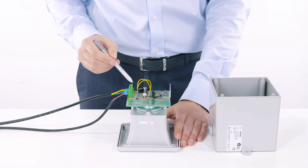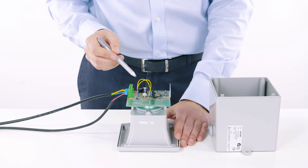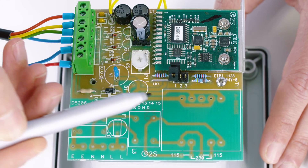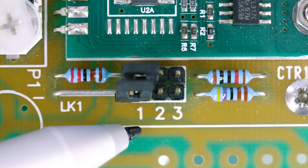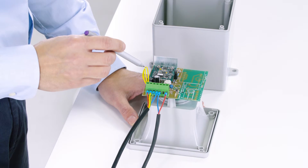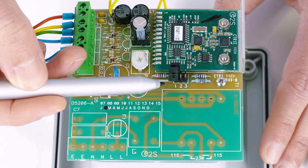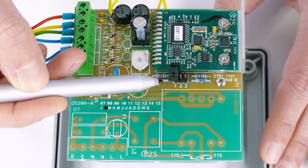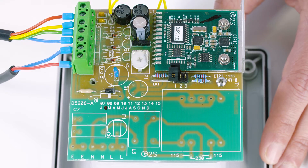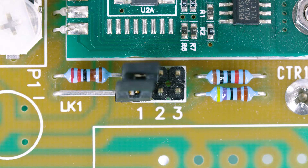Each of these sounds has two additional remotely selectable alarm stages. The first stage tone is selected by positioning the supplied jumper connectors on the pin headers marked 1, 2 and 3 of the jumper set. The first stage selection will determine the sounds associated with stage 2 and 3. In the factory default position, the jumper connectors are both disconnected, so the tone selection is tone 1 — the industrial hooter — for stage 1, tone 3 the medium frequency siren for stage 2, and tone 5 the mechanical bell for stage 3.